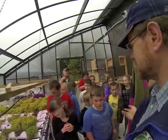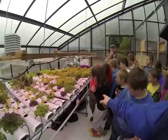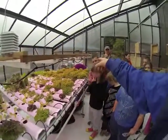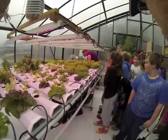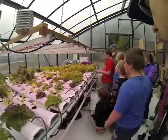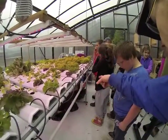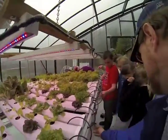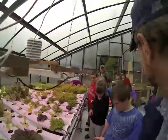Ponics is basically growing things, so hydroponics is growing things in water. If you see this tank they're working on down here, they're cleaning it out and they're going to put some new water in it. They fill that up with water. Right back by Madison there's some buckets, and in those buckets is fertilizer. See those black hoses connected to those clear hoses? That's three pumps that pump three different kinds of nutrients into the water. It flows through from a pump through this pack, then up into each of these and into these little tubes — those are called spaghetti tubes.